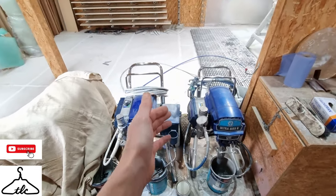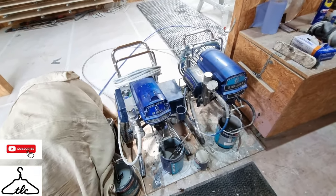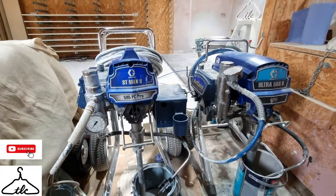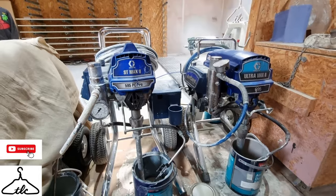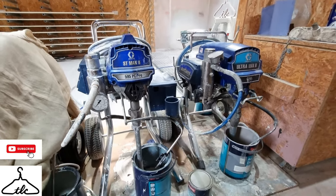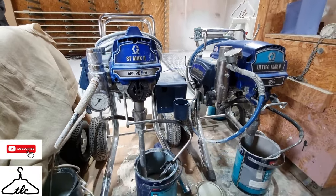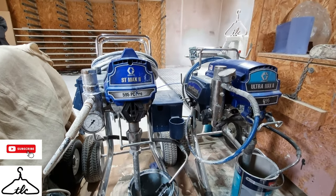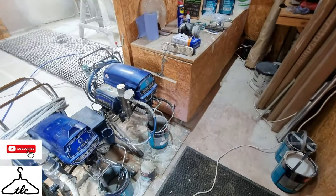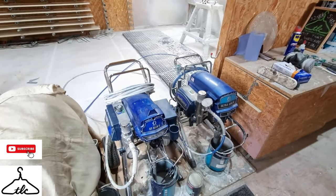These all run off 110V with a yellow transformer box. They work on very high PSI — up to 3,300 — but you don't want to spray that high. You want to get the pressure down as low as possible for the best quality fan pattern from the tip. We spray anywhere from 1,200 up to 2,200 PSI, depending on the paint, how cold it is, and the viscosity. Generally that range gives us a nice finish.